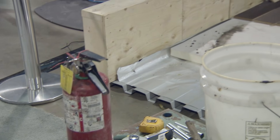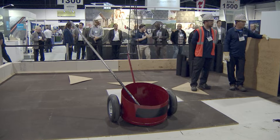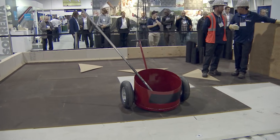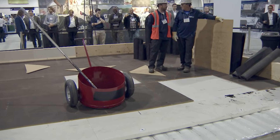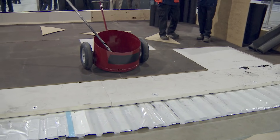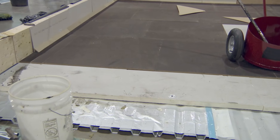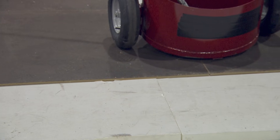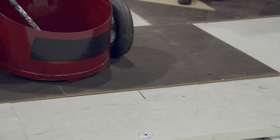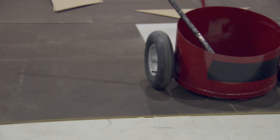The contractor is responsible for walking the steel deck if it's new construction. Even if it's old construction, when you tear it off you're looking at the deck to make sure it's solid, there's no rust spots, no holes that need to be replaced. Then you put your vapor retarder down, held with an adhesive or self-adhering, or loose laid with joints done if you're mechanically fastening your insulation. Using a cover board like fiber board breaks the thermal bridging of your mechanical fasteners. If you just leave that and put your membrane over top, you'll have heat transfer and condensation, which leads to premature system failure.